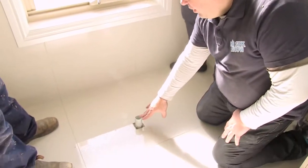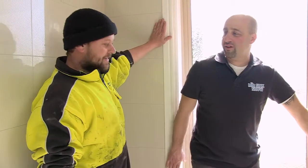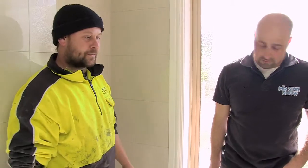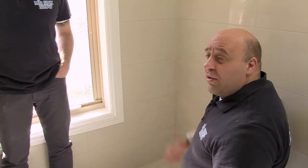The trap is already in. I've noticed the tap outlet is over here on the end — is this the best place? Majority of the time it would be in the center of the bath, but we have a very low window here, so some people might prefer it this way. They want more light in the room and opted for the bigger window. The solution is a swivel and longer tap. With freestanding baths, you must have good reach on the spout. Make sure you always have a long reach, and in this case because it's on the end, use a swivel spout so you don't hit your head.